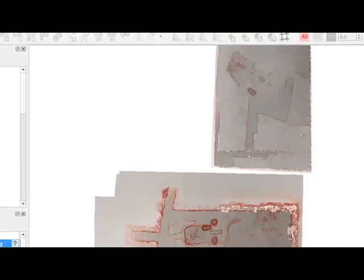Now, if I was doing this in a more high-tech fashion, the basic principles would remain the same. With a total station, you still need reference points to work from, and it's still a good idea to have baselines to facilitate a representative survey of a site. If I was using something like a network-enabled GPS, which would give me a couple of centimeters accuracy by communicating with both satellites and the SmartNet system, I would do a survey basically walking over the site in transects, taking points and records as I go. That would give me the 3D character of the site, which I could download and put into a geographic information system.